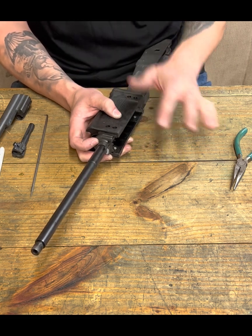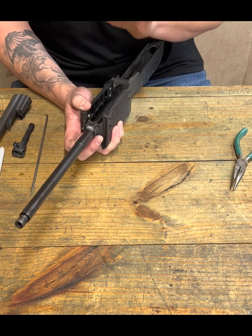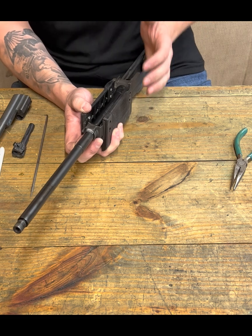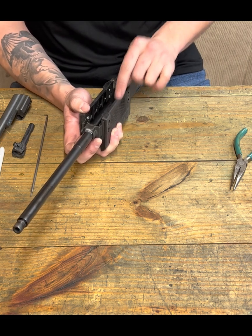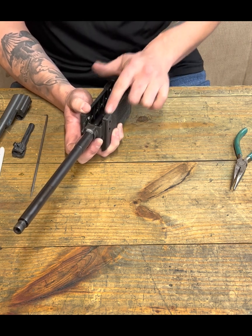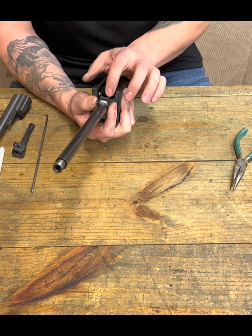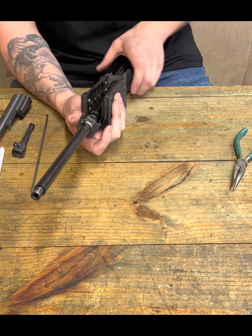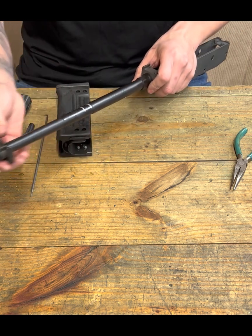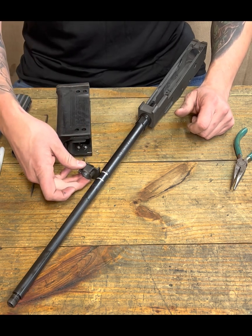I don't like doing any of that. What I like doing is saying, in this case, for this gun and these parts going together for the very first time, with all of these dimensions and those tolerances that stack, I would rather have this all tight, and this is where I know it wants to be. Then when I remove this and get it out of the way, I can take all this off, because I've measured it. That is where I want my handguard retainer to go.